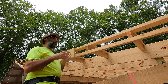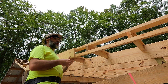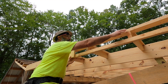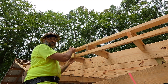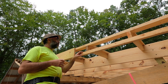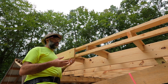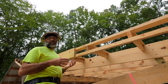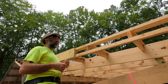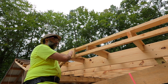A lot goes on in an I-beam and a lot goes on in this structure — it's a really good approach to build a stiff, strong, lightweight overhang and fascia without putting a big heavy board out there that could defeat the whole purpose. So again, you take your blocking that came out underneath the purlins, attach a top and bottom cord, then screw down your fascia board — you can nail it as well. There's a little more labor involved dealing with multiple pieces, but compared to hoisting up a big heavy 2x8 trying to get it in position — especially working alone — that's not easy either. This way you're spreading out your fasteners, you're not screwing into end grains, you're attaching across the grain, and you really unite everything with the fascia board when it goes on the end.